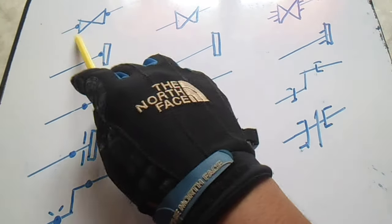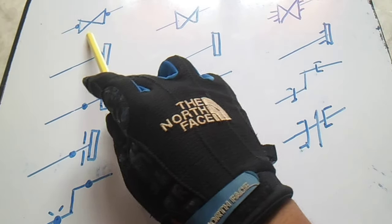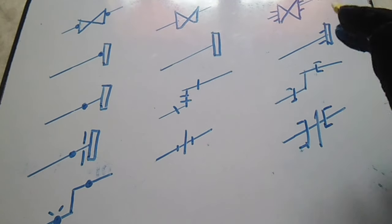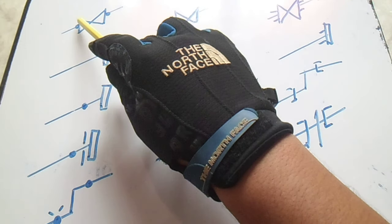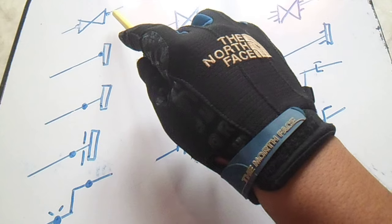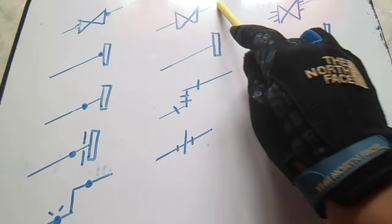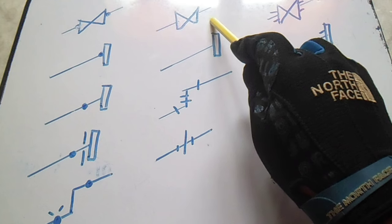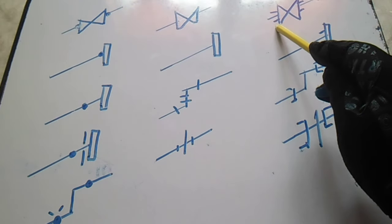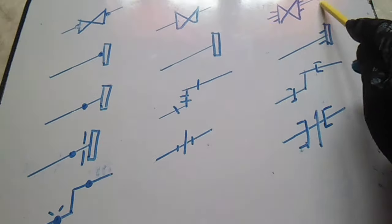You can see these are different from the first gate valve — we have three gate valves shown here and they have different symbols or different joint types. If you see this dotted line, this is a gate valve with a butt weld. This normal one here is a gate valve with a screwed joint — remember this symbol for screwed joint. And this gate valve has a line here indicating a socket weld.